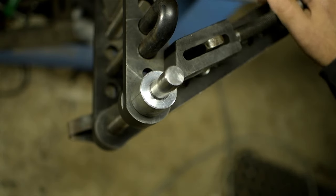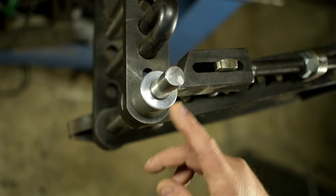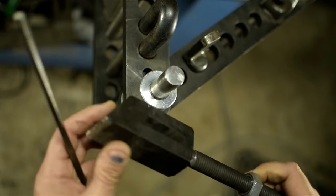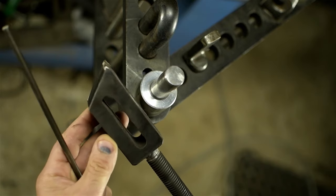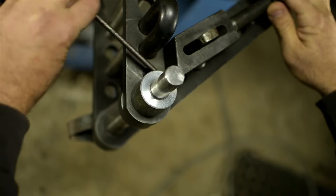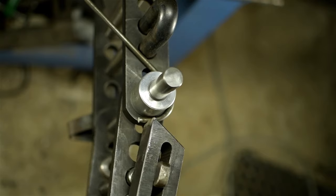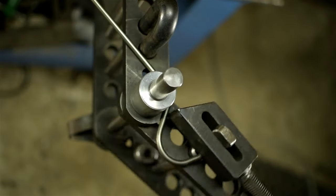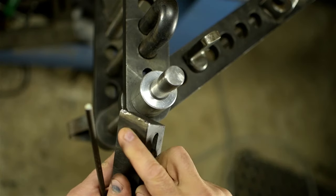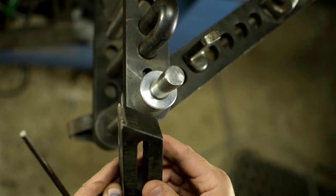This is my manual bender, a Hossfeld clone — built this myself, gets a ton of use. The frame's been heat treated, most of the pins are pre-hardened stock, but one of the accessories I use the most — a little bending dog of some kind — is not. This is just mild steel. Over the years I've repeatedly built up the edge; the forces on this are high and it just gets deformed. This should be a piece of hardened tooling.